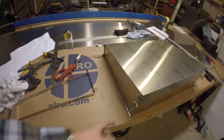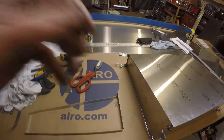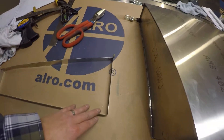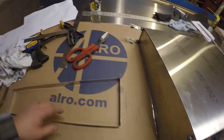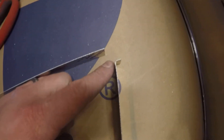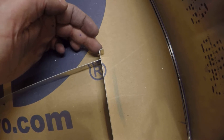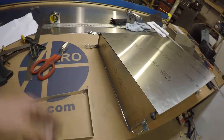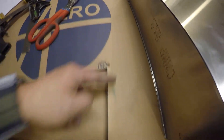The way I did this was: after I fabricated the ribs, I cut a 20 millimeter wide test piece approximately the length of the skin and then very painstakingly laid out the measurements. If you bend to the measurements on the drawing you'll be off, because if you're off by a millimeter or two the measurements won't line up. I started with a five millimeter flange — I had to bend 20 millimeters over because I can't clamp five millimeters in the brake, then trimmed it later. That's what caused this flange to be off on the angle a little bit, so it has to be bent back into position. You bend that flange in the opposite direction of the rest of the bends.